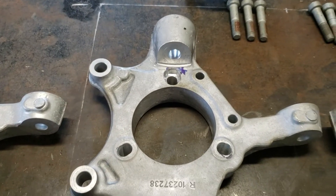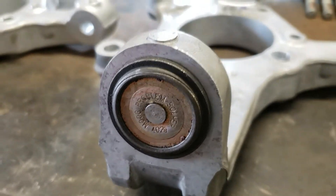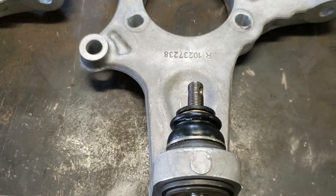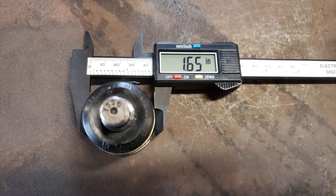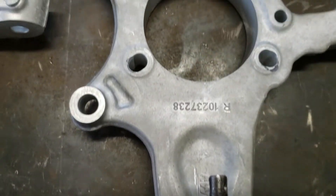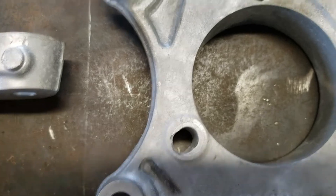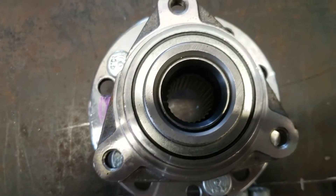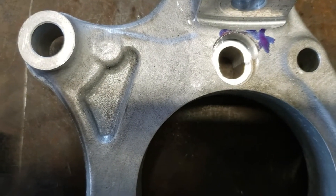The third one actually got it in. The reason it worked is because the original Corvette ball joints are 1.61 inches wide, while the Honda ball joints are 1.65, so this one got machined out so that it would fit. Also in the machining process, the holes have to be made a little more oblong to fit the S10 hubs, and because it's countersunk, it also had to be moved a little bit.